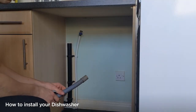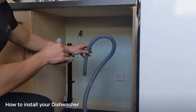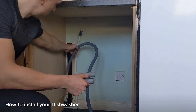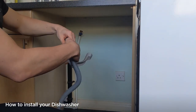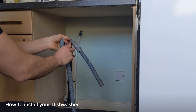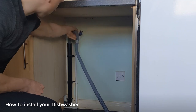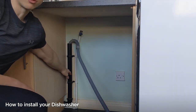So we're now ready to connect up your new machine. With this type of drain fitting, when the drain hose is sat in it we ideally want it sitting about halfway down — this is where the U-shaped clip comes in. So the pipe needs to be clipped around about there. Take your U-shaped clip, find the open end, push it in, fold it down and push it into the open end again. This will then hook the drain and it should be sitting around about halfway down.